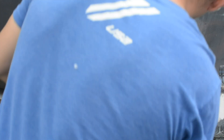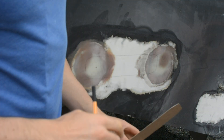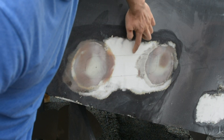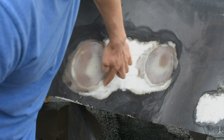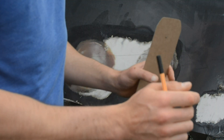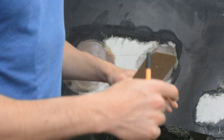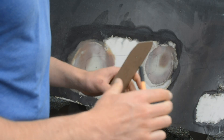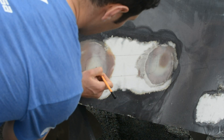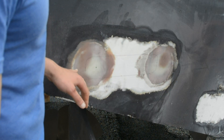Now you'll have the outline of your light. What we're going to do when we mount these is take some tape and trace three-eighths of an inch away from this line. That's going to give you a little bit of a gap for your adhesive as a sort of fillet to really seal the edge of the light when you press it up against the back of the boat. We have a mark for the hole that's going to go through the boat, and then we're going to mask around it.